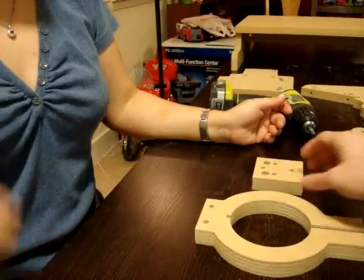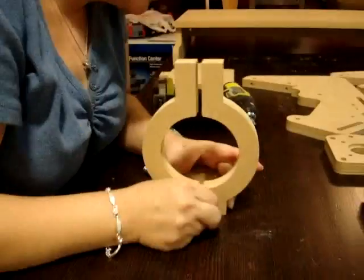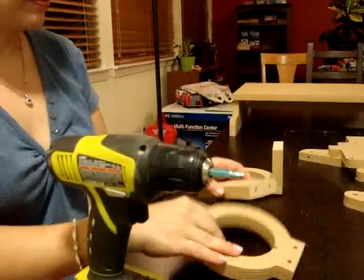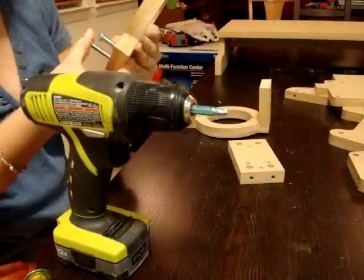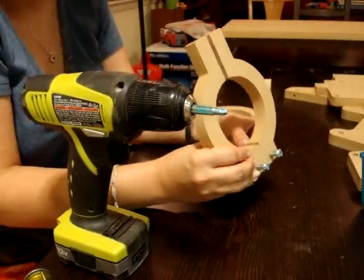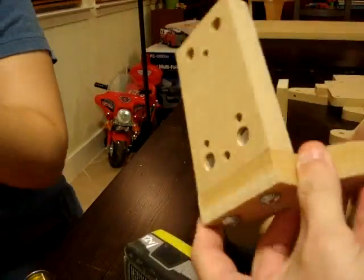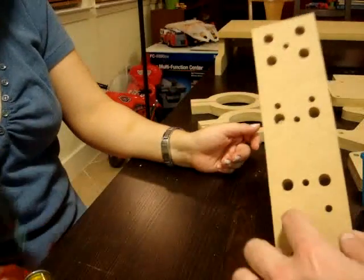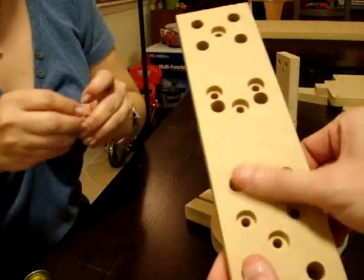This is what the table is going to look like at the end. These two pieces are for the router mount. We're going to attach this piece to the router mount using the one and a half inch screws and the cross dowel. Now we're going to attach the router mount to this piece — make sure that the mount is where the three holes are located. The router mount will also have a hole at this location so it can be tightened. Make sure you put the screw in from this side because this will be the back where it slides back and forth, and you don't want any obstruction. These are the counter bores.